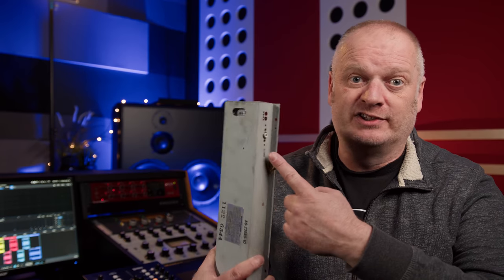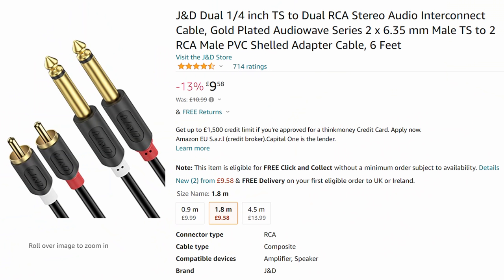A headphone output. That will feed the tank just fine and dandy, and we can take the output of the tank and feed it back into an instrument level input on the audio interface, i.e. one designed to accept signals from just such a transducer, or a DI box. And as 99.999% of reverb tanks have RCA connections on them, all we theoretically need to make this work is one of these. A twin jack to phono cable, and any EQ necessary can simply happen in the DAW once we've got the reverb into it. So let's plug it in and see what happens.